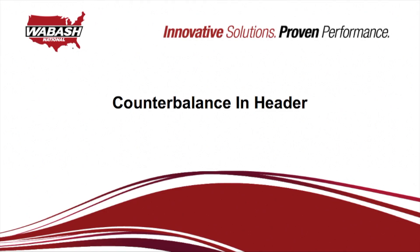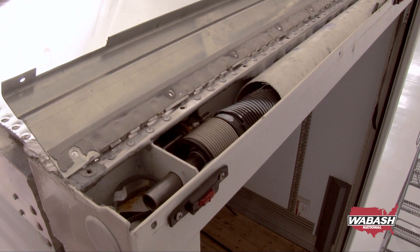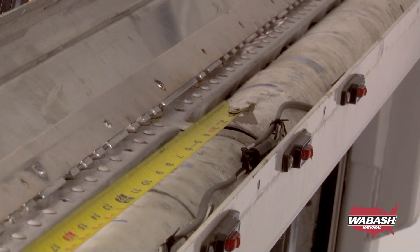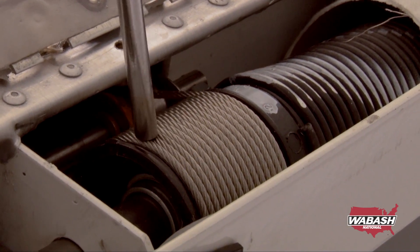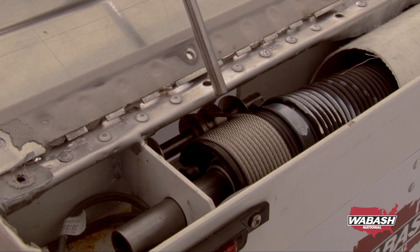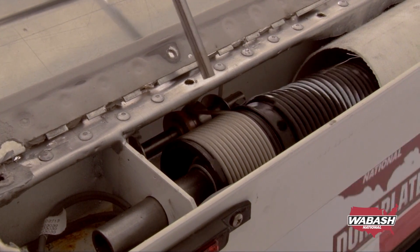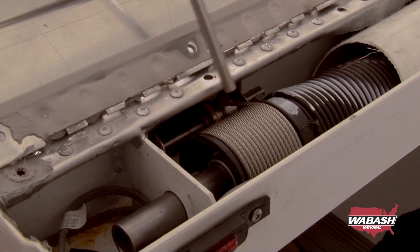What we have here is the standard double spring counterbalance, modified in only one way — out in the middle is where the adjuster is set, with the adjuster valve having the shaft going through it and pinned, so that you wind or unwind the spring by just turning the bolt on the underside of that adjuster. We'll have Moe pull the door up and down so you can see the cable feed as it pays out going up and down. You can see how it pays off the spool of the idler and feeds right onto the cable — it's just a relocation of the standard counterbalance used in the industry.